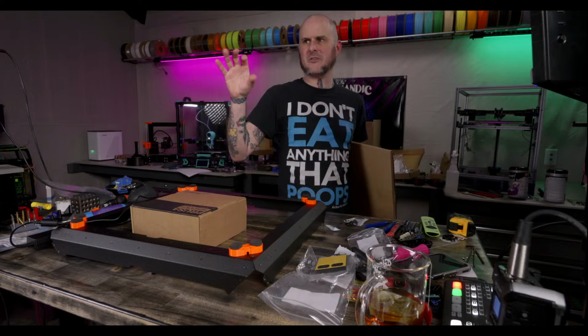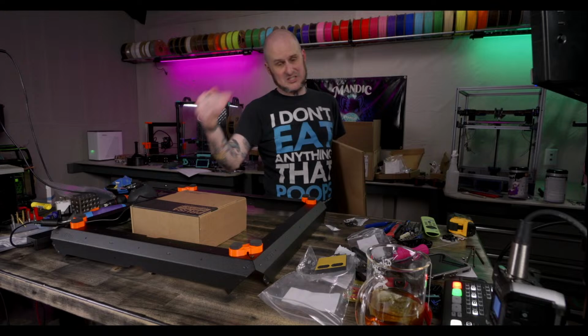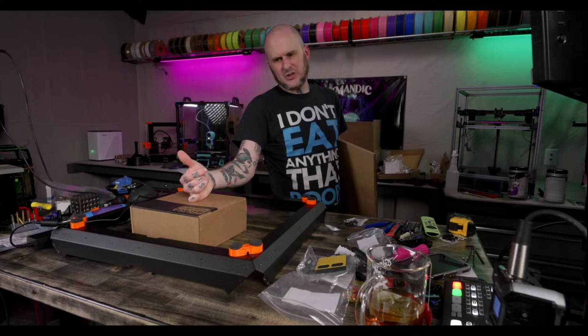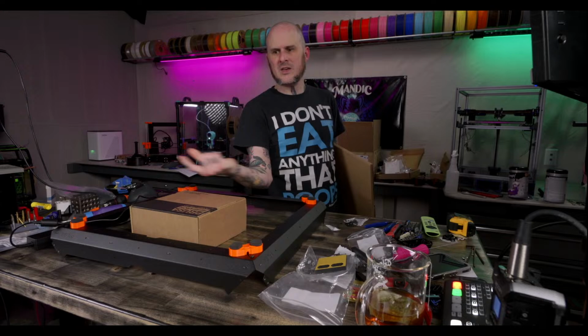So taller layers, a lot of flow. Generally, I print anywhere between 300, 350 on infill almost exclusively, 200 on inner perimeters and like 125 on outer perimeters, but that's for bigger designs. Lately, I've been printing a lot of small stuff, and I really slow down for the small stuff to maximize layer times.